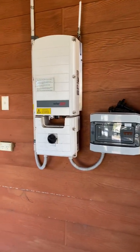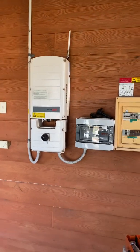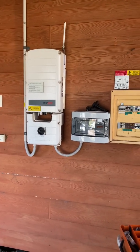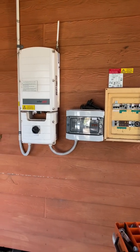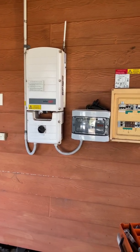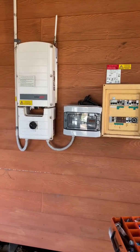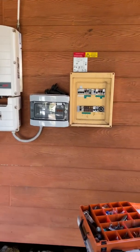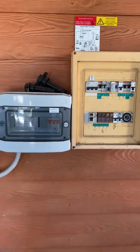Today's job is a bit of a different one. This house has a SolarEdge three-phase inverter and the clients want battery backup — they want the battery to be able to do seamless backup, to island, meaning go off-grid, and a couple of other features that I couldn't really achieve with the present three-phase setup.